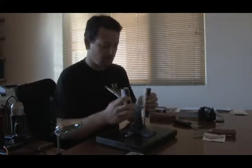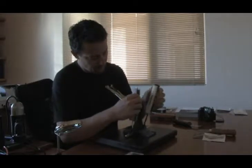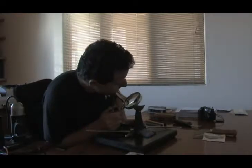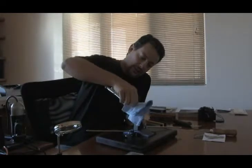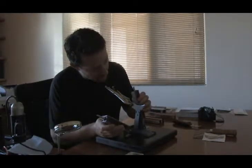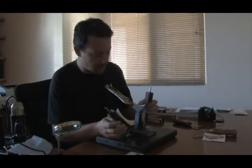And then switch grits. And that's created a really nice looking edge there. And take a look at it under a little bit of magnifying. That looks really nice. The reason we didn't go finer than the 600 ceramics with these curved blades is because we didn't want to duplicate what our strops are already capable of doing, and they fit right into the curve of any of these hawkbills or the recurve blades that we've tested just great.